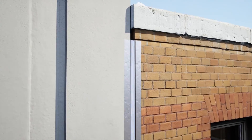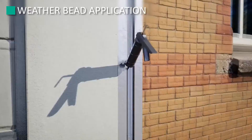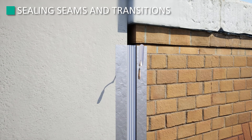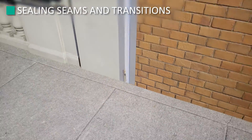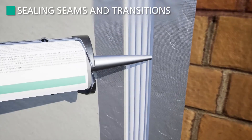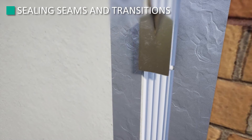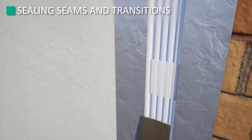Run a quarter-inch bead of the supplied silicone along both sides of the joint where the foam stick meets the joint wall. This will assist in creating a weather-tight seal. Tool each bead to form a smooth, concave cant bead on each side of the joint. Run a small bead of the supplied silicone splice sealant over and just under the surface of the cured sealant in all butt-joint seams and transitions. Tool all butt-joints and transitions, ensuring the sealant is adequately wetted out on the surface of the sticks and fills any voids in the splice. This also creates a clean, aesthetic finish.